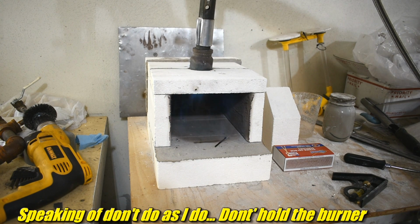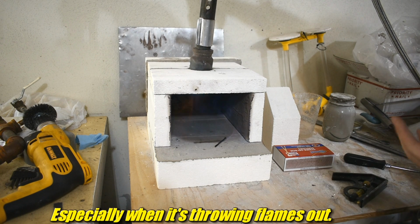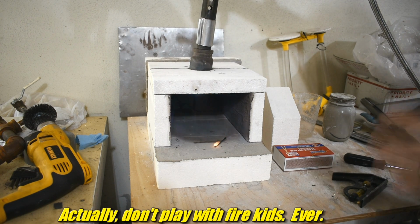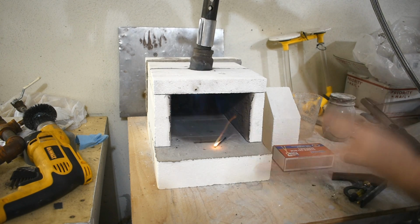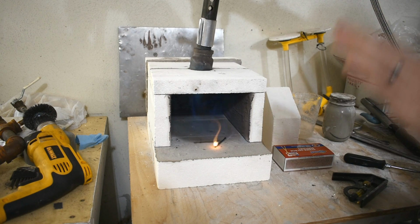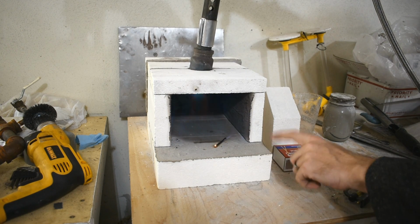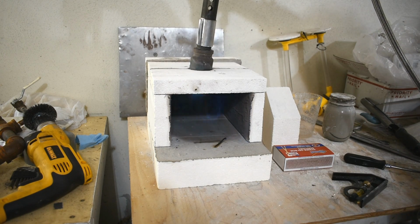And the way you cure the Satanite, after you get it nice and dry, you fire it up and wait till it's good and hot, like turning red hot. Nice and usable temperature. Then, lastly, you take the thing out, turn the fire off, and let it cool down. When it gets red hot, and then you let it cool down slowly, it sets in this furnace lining and gets that nice and ready and resilient to the heat.